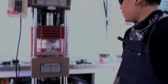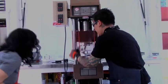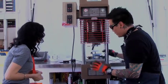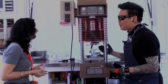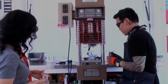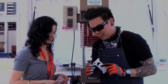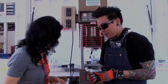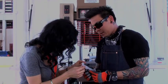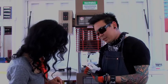Give it about 20 seconds to cure and we'll pull it out and see if we've got a good mold. All right, let's see what we got here. It's looking pretty good. It's 250 degrees of hot, so that's why I'm wearing gloves. And there we go — we've got a bit of plastic. Looks like we need to up the pressure a little bit so that we can get our corners going, because it just shot a little too little material.